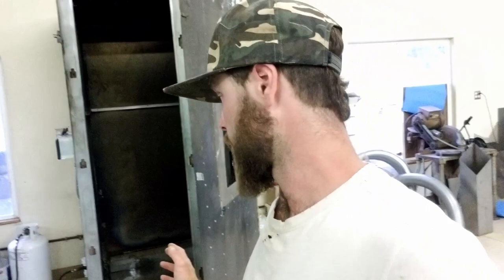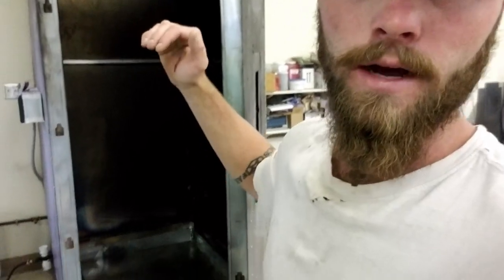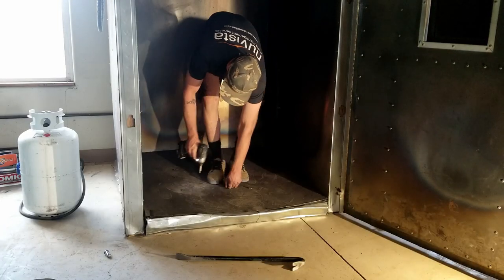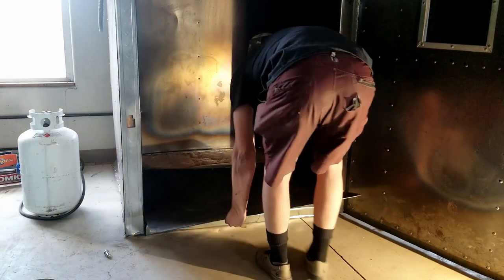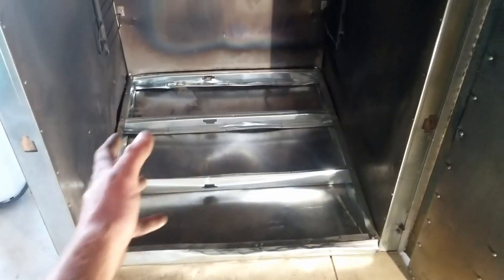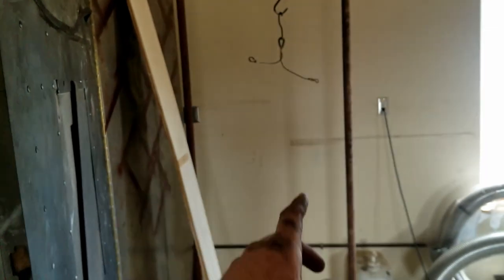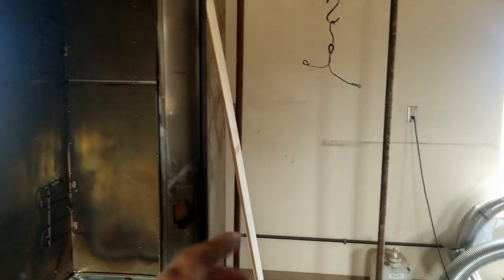The other upgrade: when I first built the oven, I built it up on wheels so it was movable, and it had a four-inch floor in the bottom because of that. Since I moved to the new shop, I had to drop it down to fit, so I no longer needed the floor since the oven is sitting on the ground. I unscrewed the top sheet, took out all the studs and insulation, and essentially pulled out all the framing of the floor but left the lower sheet metal to give the whole box some structure. That way I can take my oven rack, throw some metal wheels on the bottom, and go from powder-coating on the rack directly — putting the whole rack and part into the oven — without having to lift the part off the rack when it's covered in powder coat, which is just a pain to deal with.